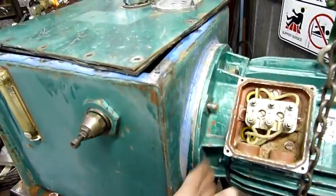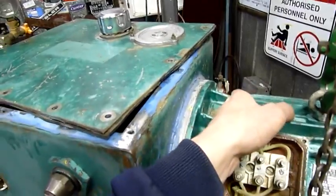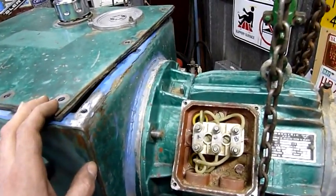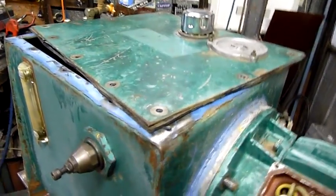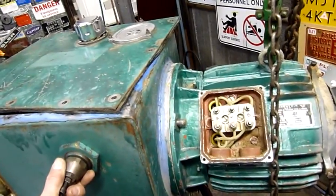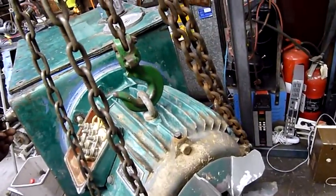They've really gone to town with the blue max — not to say it hasn't worked; it worked really well. As I've said in previous videos, the plan is to split the motor stator off and just make an output coupling using part of the old motor's rotor, and couple that straight to the Yanmar. Now, the pump rotates and the direction arrow's pointing that way, so it's going clockwise from the motor end. So I'll just look at the way the Yanmar rotates — which direction would that go? It'd probably go the right direction, so I could probably couple it to the front of the engine. I can't quite remember right now what direction that goes — should be counter-clockwise from the front of the engine.